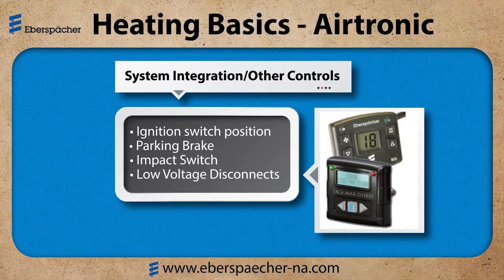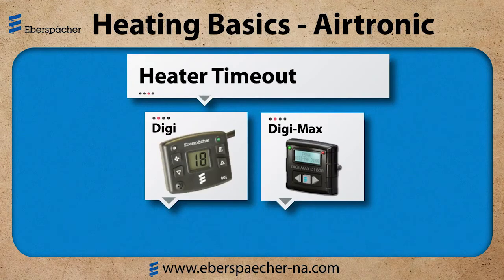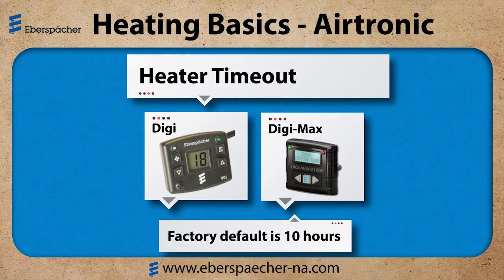Our Digi and Digimax controllers also have a timeout feature. That means that once I press the button, the heater's going to run for a preset amount of time, and then it will be shut off. I can always start and stop the heater at any time by pressing the button again. The factory default is set at 10 hours. That means if I press the button to start the heater, 10 hours later, the heater will shut down. On the Digimax controller, there is actually a countdown timer on the screen, so you're able to see how much time is left before the heater will shut off.